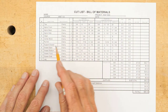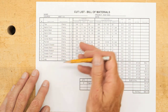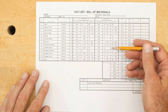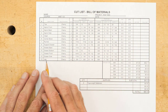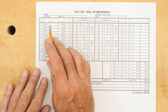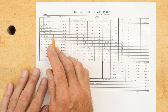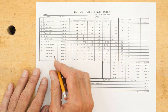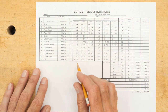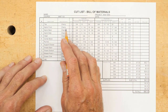The first thing I'm going to do is look at my cut list and parts, and I want to choose the biggest parts first. I've got these roughly in order of how I'm going to be making the project, and also in order of size. Everything from part number 1 to 12 is going to be 4-quarter material. The legs are 8-quarter, so I have them separate. The biggest and most visible part is the top, so I'm going to be looking for those parts first, then the aprons. One thing to keep in mind is the drawer front — it's actually part of the front apron, so I can ignore it as a separate part. Let's get started with the top and aprons.